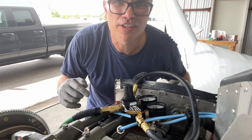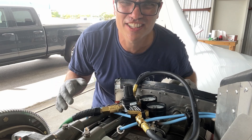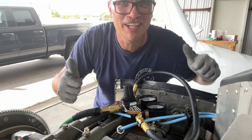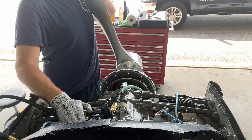I'm gonna go around and do all the cylinders by myself, even though it's probably not a great idea after discovering how much force that prop puts on it, but we're gonna do it anyway. Okay, that's it for compression testing. All of my cylinders are in the high 70s over 80, which is great. It's a brand new engine — shouldn't be having any problems. Knock on fiberglass.